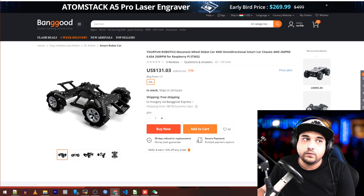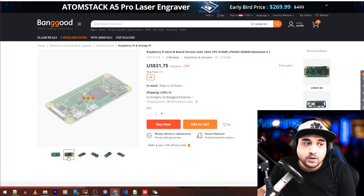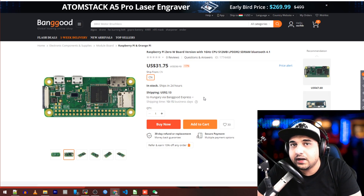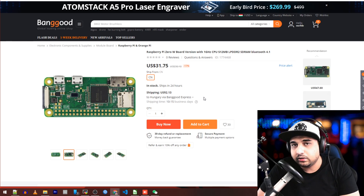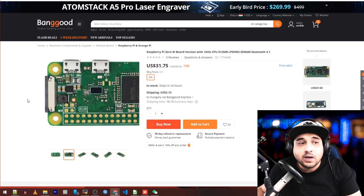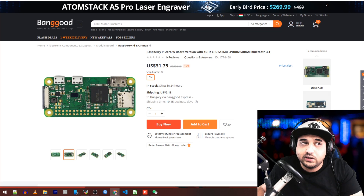I've also ordered some more microcontrollers, for example the Raspberry Pi Zero W. Why did I order this? I'm afraid the ESP32 won't be able to broadcast live video, and I know for a fact the Pi Zero W would. So if you really need a good live video broadcast, this is the implementation I'll be using. I'll be doing a lot of Raspberry Pi and ESP32 work - mainly concentrating on budget stuff first, and for larger projects we may have to step up. It's very important that you get the Zero W because the W means it has Wi-Fi and Bluetooth.